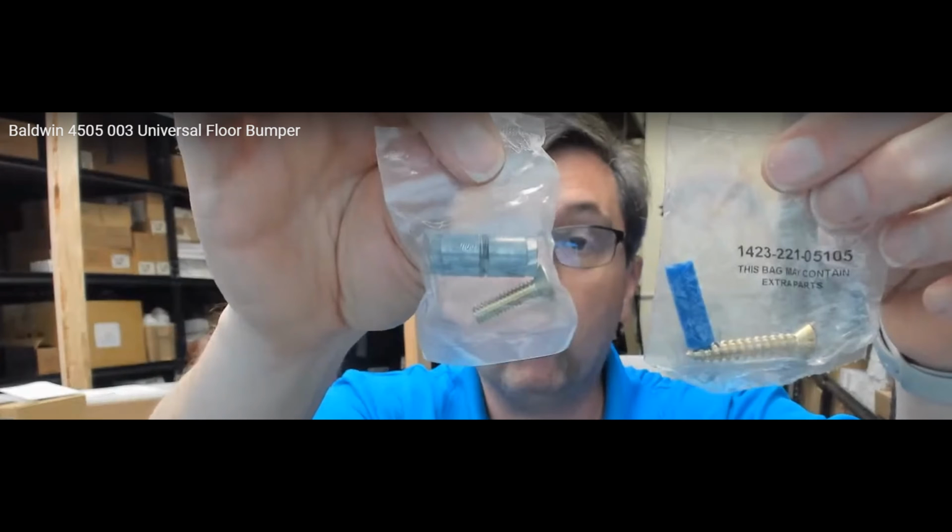Yeah, so a hinge pin door stop would work because you probably don't have all three spring hinges. And if you do, you could remove the bottom one and the top one and replace them with a traditional ball bearing hinge of the same leaf thickness and width. So you may be able to make that work.